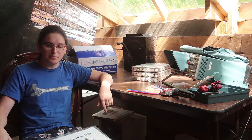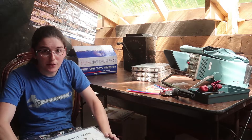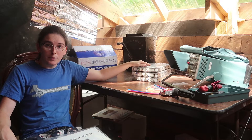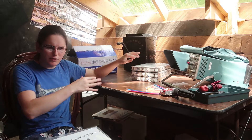Welcome to the reboot of Solar Sunday. I've decided for my workshop I should aim for a 24 volt system and I'm hoping to get 1000 watts of panels on the roof by the end of the year. The reason I went for 24 volts is because the inverters seem to be a lot more powerful, and also my Nissan Leaf battery packs configure really well to make 24 volts. This is a 24 volt, 60 amp hour battery pack — really nice and condensed, I love it.